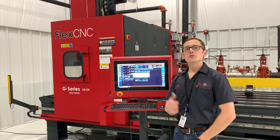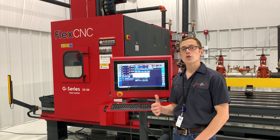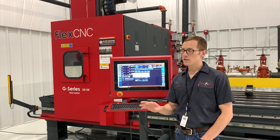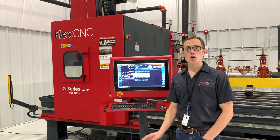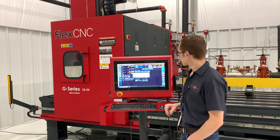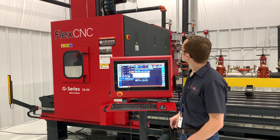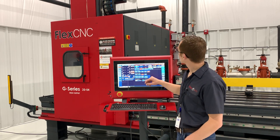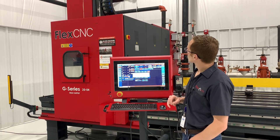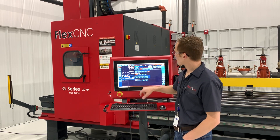Keep in mind while that's homing — this machine has the old G5 drives, so we have to home out each axis. But on our new S1 drives, when you fire up the machine it automatically knows its position and there's no need to home. All right, Z-axis home. Once the head moves up and finds its position — Y-axis home, and X-axis home.